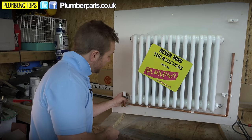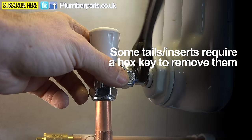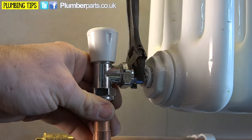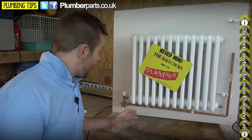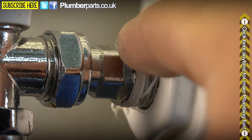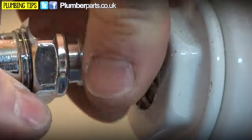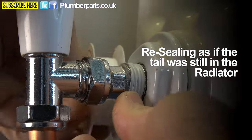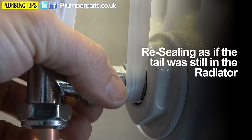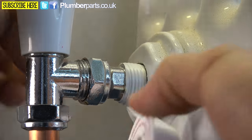You shouldn't get a lot of water out. Once you've slackened the nut, get your adjustable spanner on the hex and start unwinding the insert. Unwind it to expose at least four or five threads. As soon as you've got those threads exposed, wrap your PTFE round — and if you want, try and clean off any old sealant first. You can either just expose three to five threads safely, or if you want, completely remove the insert and work with it on your lap. Get all the old sealant off, then apply your new sealant. Take note of how you wrap the PTFE — it must be wrapped in the correct direction so that when you screw the insert back in, it doesn't push the PTFE out and fail to seal.